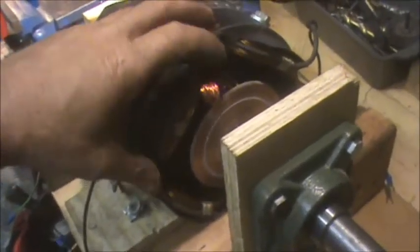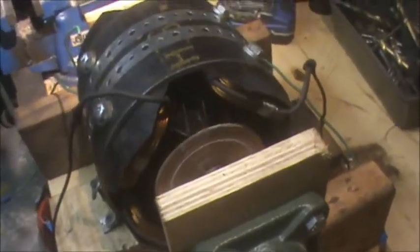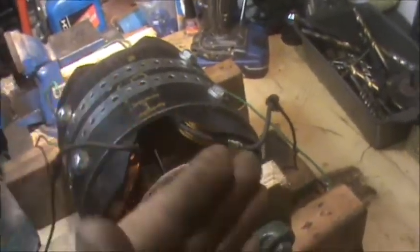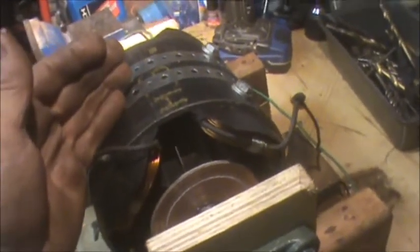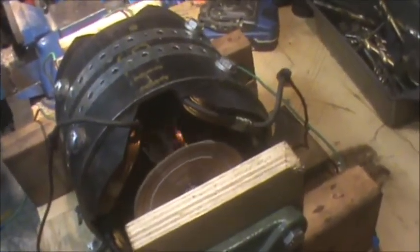This should run like a motor and also act as a generator. Think of every revolution having two stages — the DC is going to run it through one revolution once it gets up to speed, and then it switches back and forth. Under any kind of load, the DC would never be connected during the reaction torque. So it ends up running like a DC motor while also acting as a generator — a flip-flop so they're never colliding with each other.